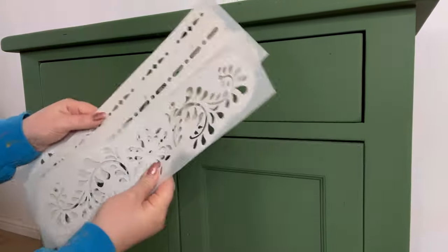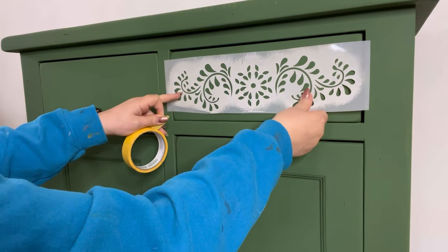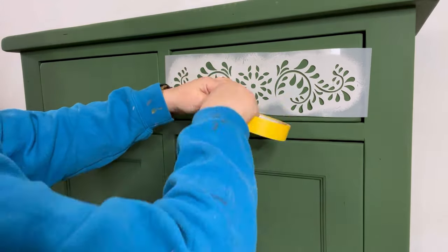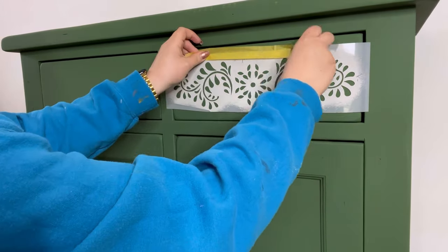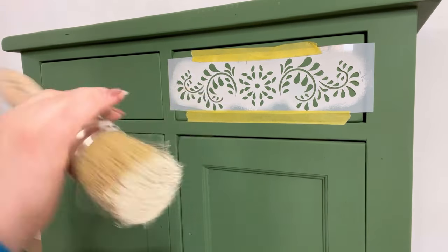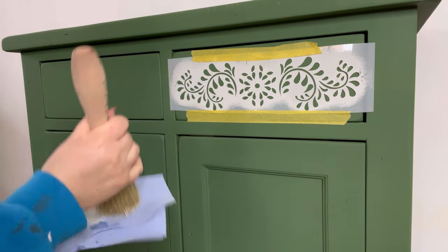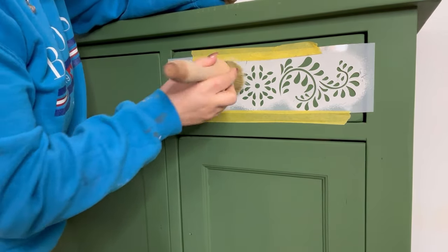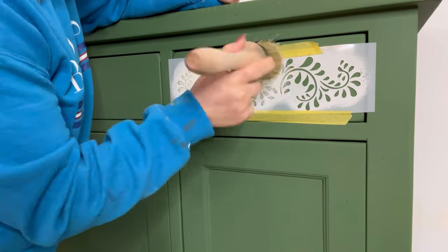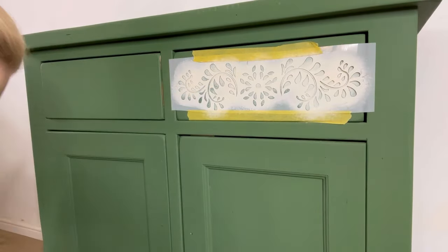Once that's dry it's time to start applying the stencil. I've cut up my bone inlay stencil as this makes it easier when using the small sections on different areas. I'm then going to get it into the position that I want and use some masking tape to hold it in place. Now I'm using my Bestang brush to stipple on the Sandbar onto the stencil. I pick up a small amount of paint onto the brush and then dab off the excess onto a shop cloth. When applying any stencil, less is always more — this will help you avoid any bleed through and create a nice detailed design.